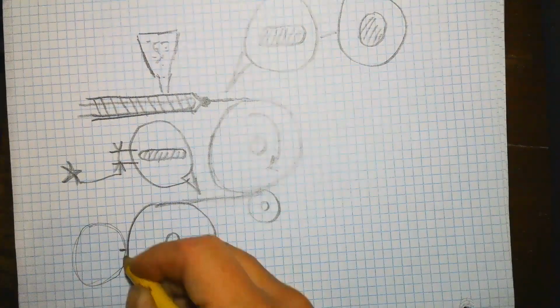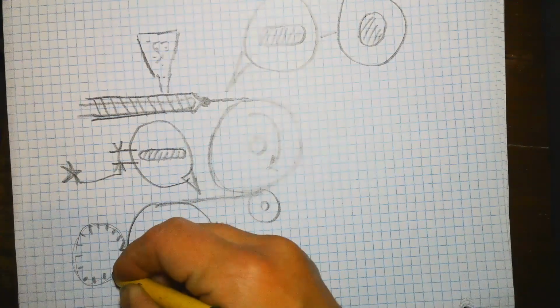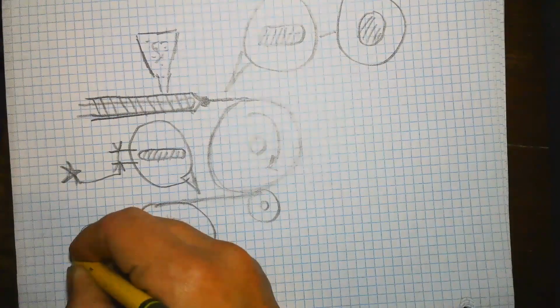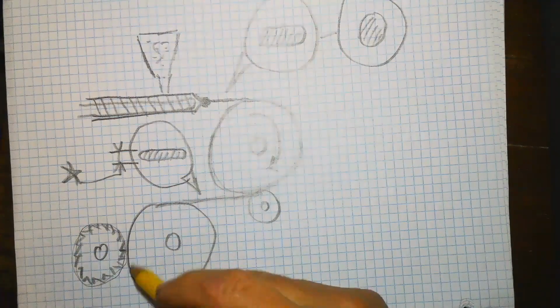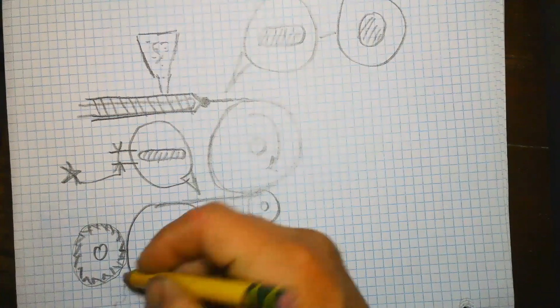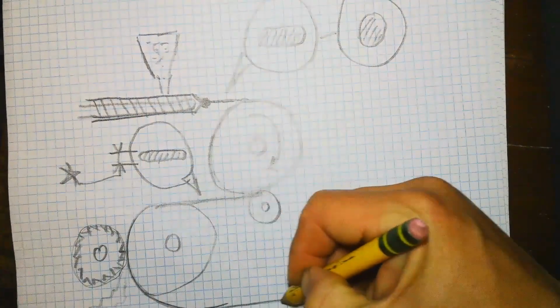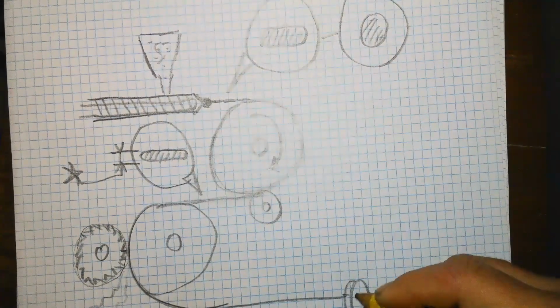the plastic ribbon. Partially cooled plastic would then go over another roller, and this roller meets two blades. I've drawn them here kind of like saw blades, but I kind of imagine them more like pizza cutter or can opener blades. These would cut off both of the irregular sides of the ribbon, constraining it to an easily controlled width just by adjusting the distance between those blades.